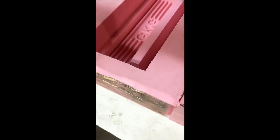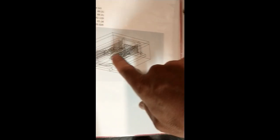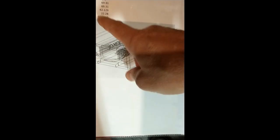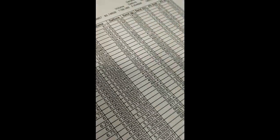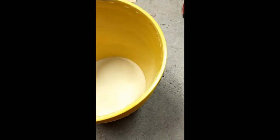These are all molds that are part of the assembly, and when we put it together it will look like this. The total volume is 203 cubic inches. We come over here to our chart — that's 205, which is close enough — so it's 3733 grams of sand set up in here.